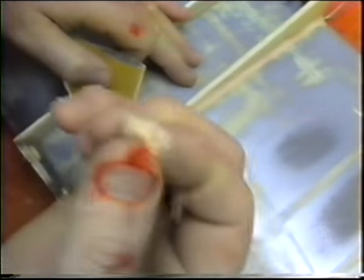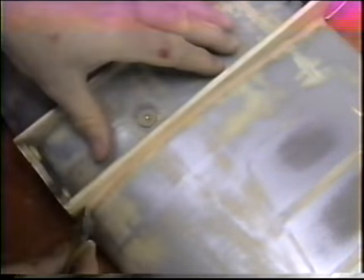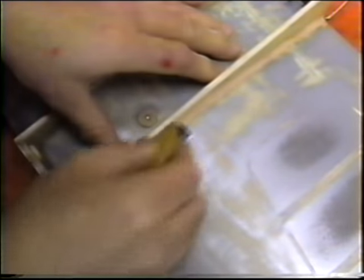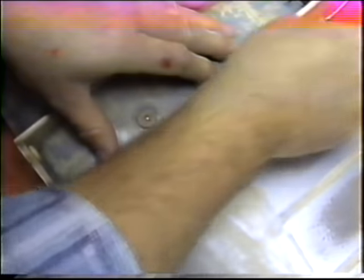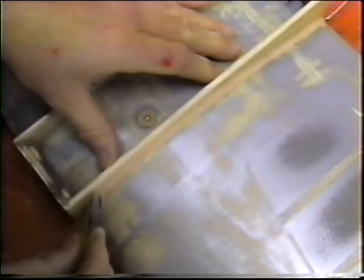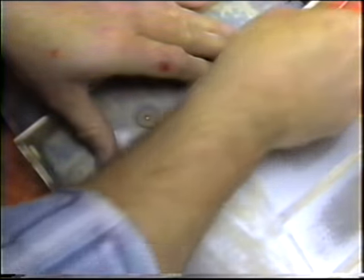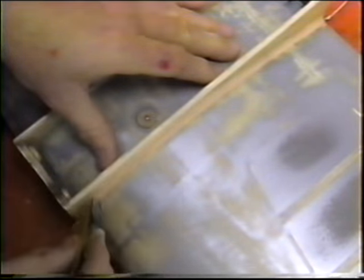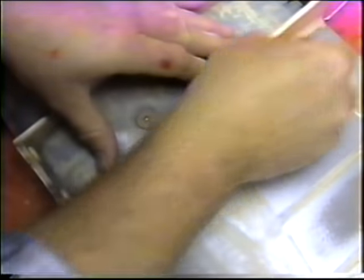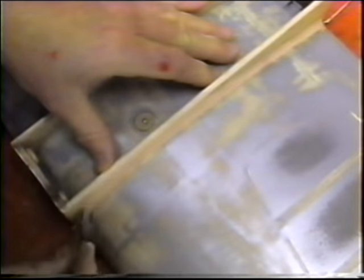Now you can see when aeropoxy is totally cured, it turns to powder. It doesn't turn to chewing gum. Some materials in the past that I've used, you may as well feel like you're sanding a piece of chewing gum or an old tire, a snow tire or something. This material just sands really easily. I'm going to do the whole sand out on tape because I don't want people to think it should take 5 hours to do this.